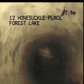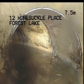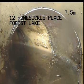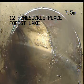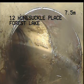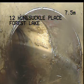And then we track down, and around, and I notice we've got water at this point now. I think at this point we're actually getting very close, if we're not already at the boundary of the property, and we're heading into the main sewer. So I'll jet rod this section and just see if I can clear it. As far as the location though, I don't know that we'd be able to actually pinpoint this as it's most likely over the fence line.